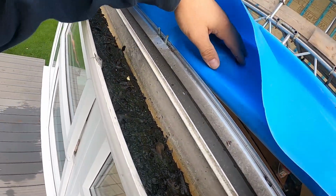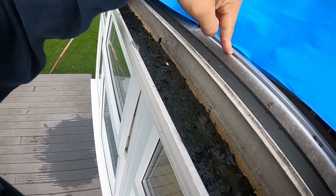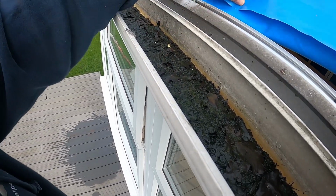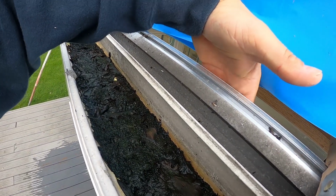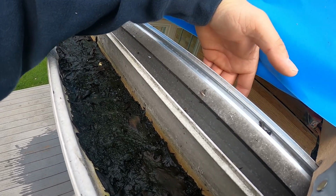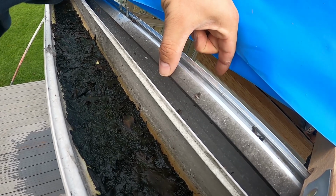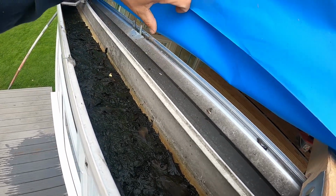So as you can see, this time we got not a square profile, but this alley is like an L shape, which is part of holding the guttering and everything else. So what we will be doing, we'll be planting timber on inside here. Also that will be for our trough. So you're going to put 4x2 on, drilled into that, screwed into the alley, and then we're going to have plate sitting on this edge and bearing on that timber once it's screwed on. So that will be supported that way.